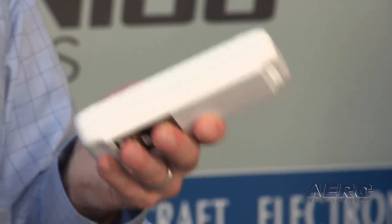Additionally, the data that this collects, so this is ADS-B out. ADS-B in today is done a lot by Stratus, a portable ADS-B receiver. But there are some compromises with a product like this. It's got internal ADS-B and GPS antennas and it's battery powered. So most people will put this up on a dash or on a side window, and it has to be positioned in the aircraft where it can see the ground for the ground stations and the sky for the GPS satellites, which is kind of awkward. And when you're only receiving, you don't get a full traffic picture. By connecting a Stratus ESG to a Stratus 2, you really take away all of those compromises and you get the full ADS-B in experience on an iPad.